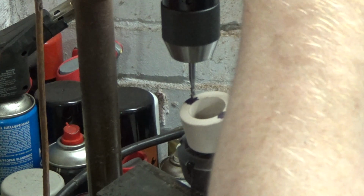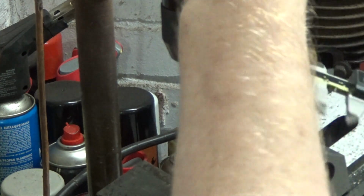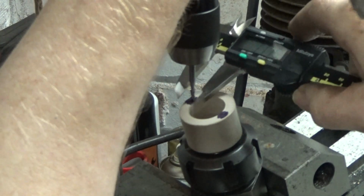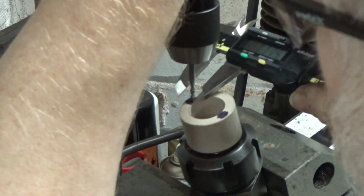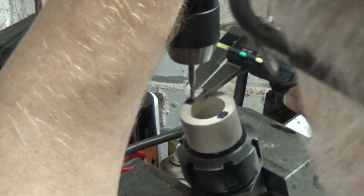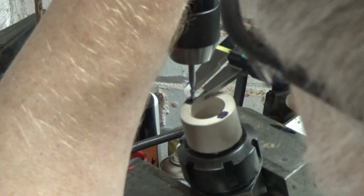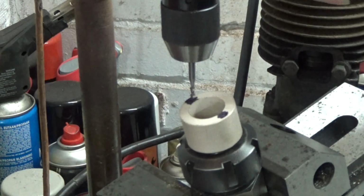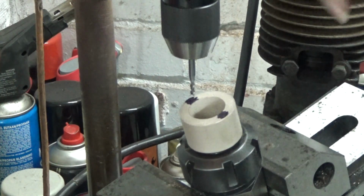The dowels are off-the-shelf parts, available very inexpensively in a range of diameters and lengths, hardened and ground to a very fine surface finish. An alternative approach would be to drill through with a 3mm bit, then ream to 1/8. At that point you could use the shanks of broken 1/8 carbide cutters as the rods, as it turns out that carbide tools are good conductors, won't corrode, and are maybe more resistant to arc damage than metal contacts.